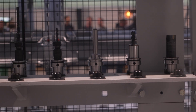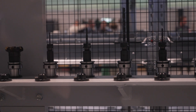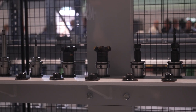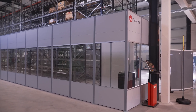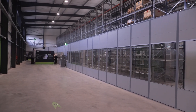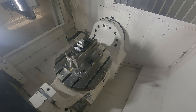Tips on a face mill or a high-feed can be changed, and once it's been done the new tools are loaded back into that block. The system will come, pick up that new tool, and put it where it needs to be. The great thing about this is they had sister tools for each tool so that the machine never ever stops.